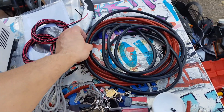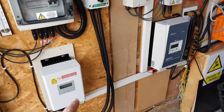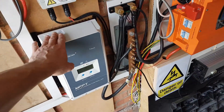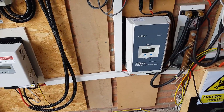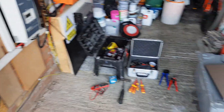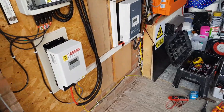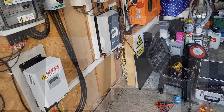I've got two of them and they also come with the temperature wires as well. I've bought some 16mm cable, black and red, to wire these in. I'm actually going to put them here and here. I might swap this one over because that's a slightly higher voltage unit — that's 200 volts — and because I've put all the panels in series at the back, I might use that in the middle. It all depends what fits where. Mine's a 24 volt system but I'll show you the software later.